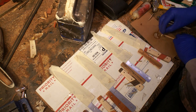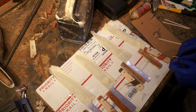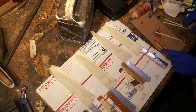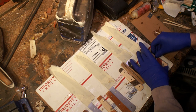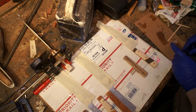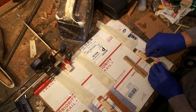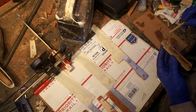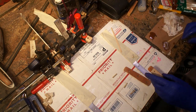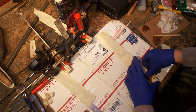Using the same kind of five-minute epoxy that I was using for the inside of the pins — this time of course it's not colored — going through getting a little bit on the pins, a little bit on the back of the scale, and then gluing it down. Since they're shaped pretty closely I can do both sides at once, but I mixed up only enough epoxy for one of these at a time. I definitely couldn't have gotten through all of these in five minutes, and the stress factor would have gone way up trying to move that quickly, so it was better to give myself a little extra time and mix up enough for one or two at a time.